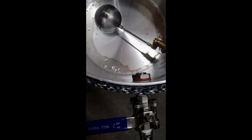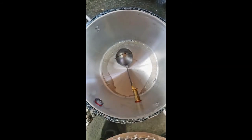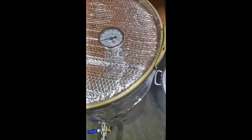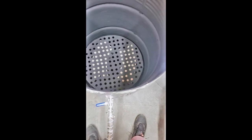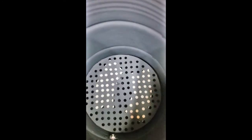I forgot to hold my phone in landscape for this final part, but this is the fittings all put in. I just had to insulate more around them and here is the final product. I did add another layer of insulation to each part except for the hose — the pipe insulation along with the metallic insulation did just fine there. In another video I will be showing you a cover that I built for the top of the boiler system as well.